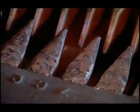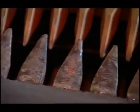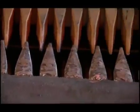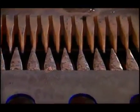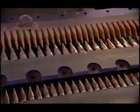To ensure that the crusher rollers are continuously cleaned and that the sugarcane bagasse follows the correct path inside the crusher, the trash plates must always be adjusted and, more importantly, well protected. UTP makes available the appropriate alloys for the most effective coverage of those parts that suffer severe abrasion, such as UTP Ledurit 65.